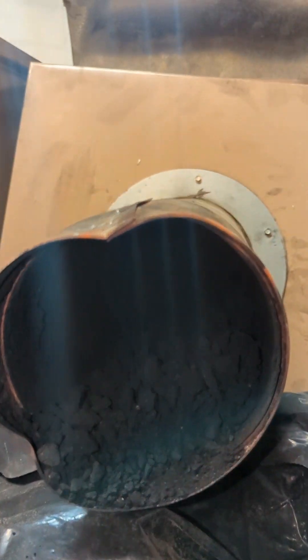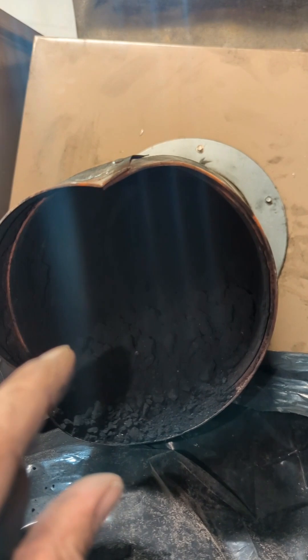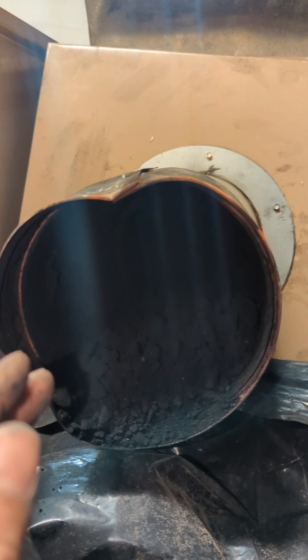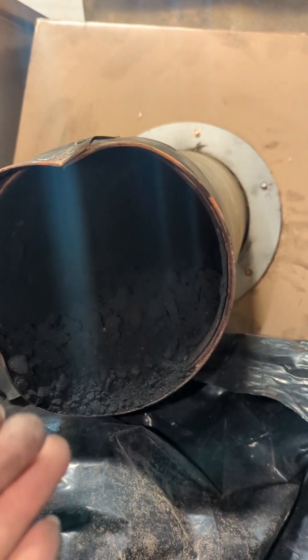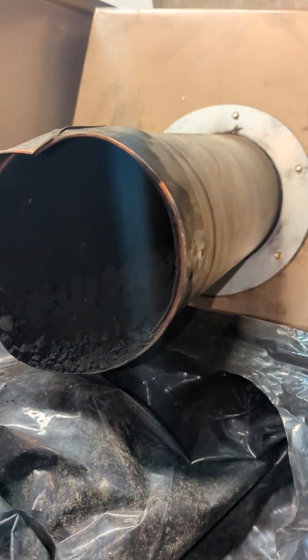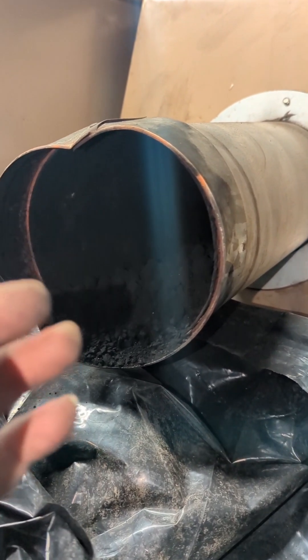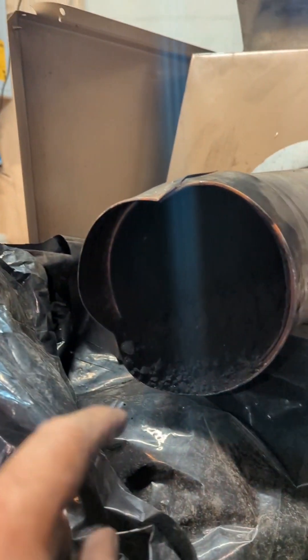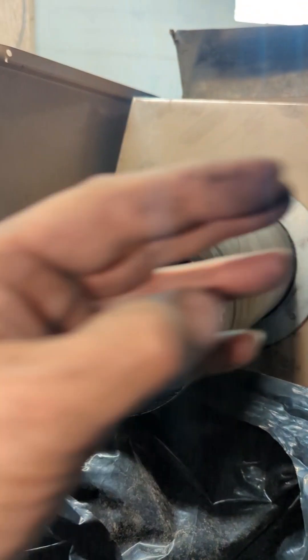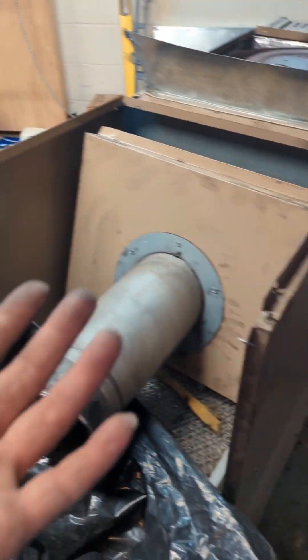That big company was saying there's a cracked heat exchanger, but not really — it's just not been tuned up properly. Over time, they've been running with high CO2. When your CO2 is very high, like 13 or higher, it produces so much unburned oil and very high carbon monoxide levels. Make sure when you hire a service tech for an oil furnace that they are honest and have a combustion analyzer. Some old folks use smoke tests, but I use a combustion analyzer — check CO2, carbon monoxide, efficiency, and the flue pipe, especially the barometric damper. If it's clear and you don't see smoke coming out, you're good. But this has been running with smoke in it — you can see soot everywhere.